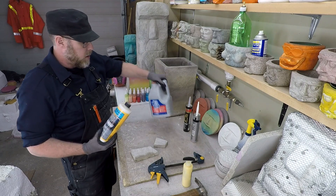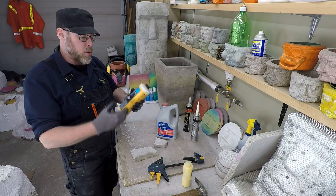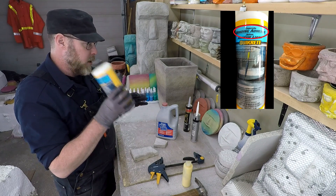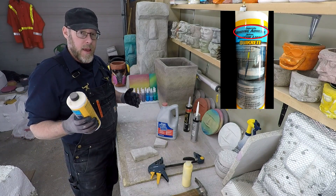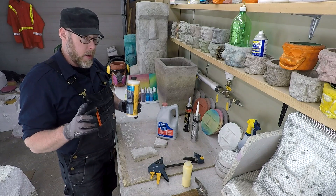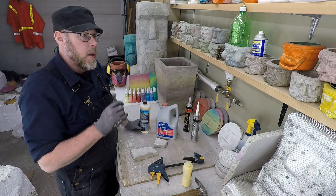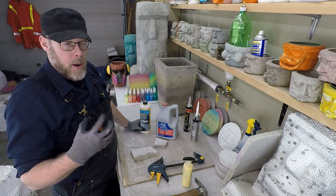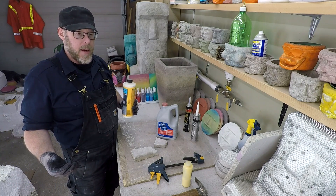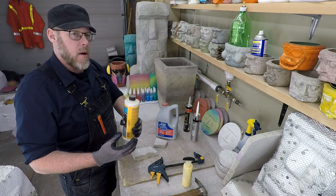Take a look at some of these here. There are usually two options available: one is thin, which is an acrylic latex, and the thicker one is a modified PVA product — so it's essentially glue. Something like this would most commonly be used as a primer layer, bonding new concrete to old concrete, or maybe making a concrete patch.